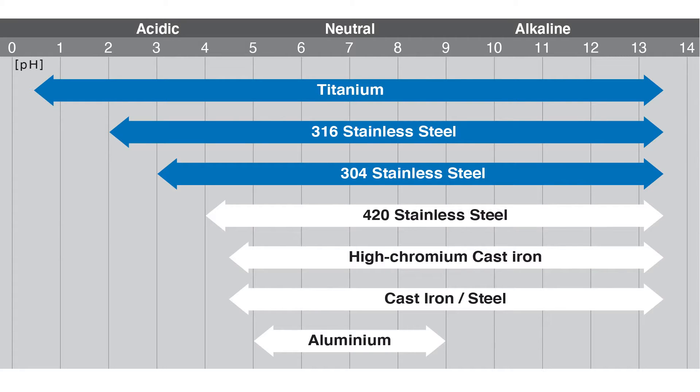If you're going to allow any abrasives to get into the pump — and you will — some abrasives will get through. That pump is going to have to handle things because it's on a construction site or a mine site. So typically an abrasion-resistant metal like a high chrome alloy impeller, high chrome alloy wear plates, heavy duty outer casings, and motor housings that can withstand that kind of abrasion are recommended. There may also be a corrosive nature to the water — if you find low or high pH, you may need a corrosion-resistant metal for your outer casing, motor housings, and impellers in order to survive the duration of the job.